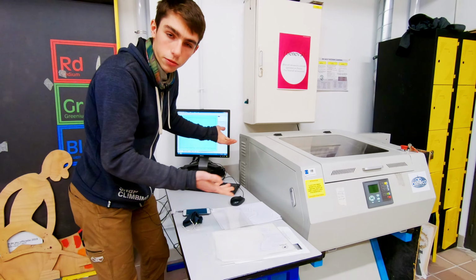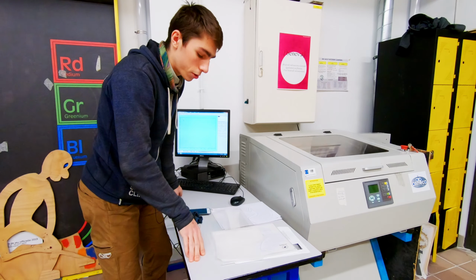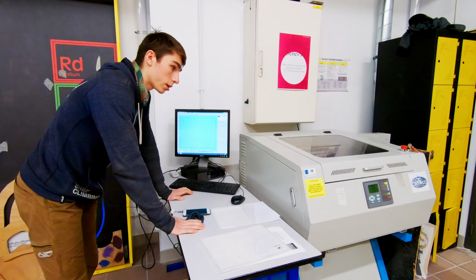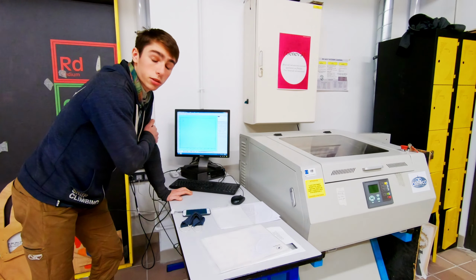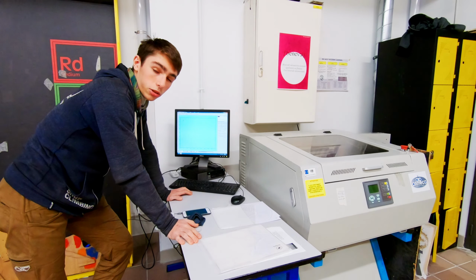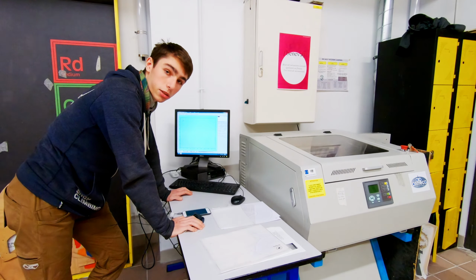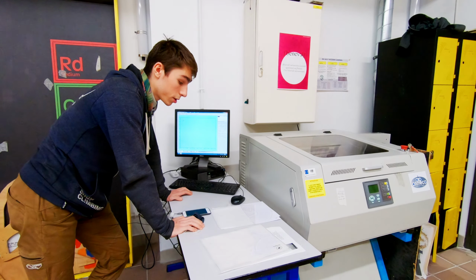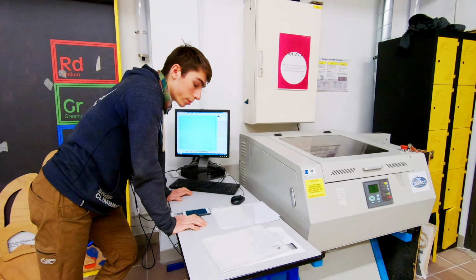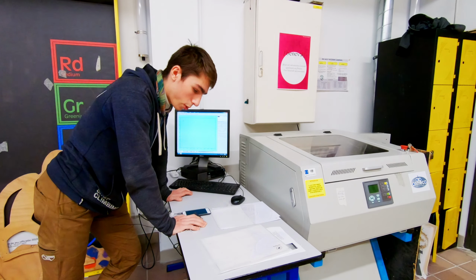that fit in the laser, first of all, because it's not that big compared to other options out there. I've placed all four different parts, and I'm first going to try out different settings with a very basic little square on the laser, just to calibrate everything for each plastic thickness. And then I'll be able to cut out the actual parts without having failed parts, because that would be a waste of plastic.